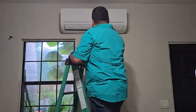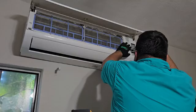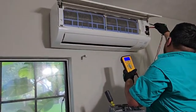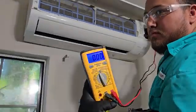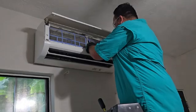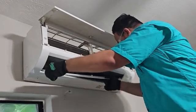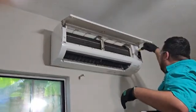Okay, so first of all, I'm going to open up the cover for the mini split system. I'm going to remove the cover for the electrical components — in this case, the wires — and check if there's any voltage being supplied to the mini split system. Because safety is a priority, we check for voltage and then turn off that breaker. Once I'm satisfied there's no more voltage, I'll proceed with cleaning. Next, we remove the filters, and then remove the air deflector from the system. There are three screws that need to be removed from this Mitsubishi system.